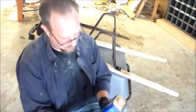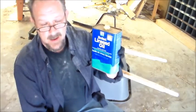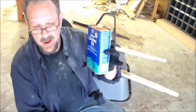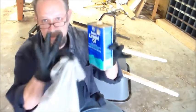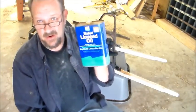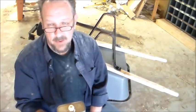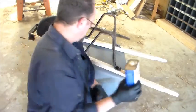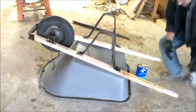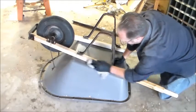All right, we're just about done. What we're going to do is put some boiled linseed oil on — this just helps protect the wood from the weather. You're going to want to put it on a time or two a year. If you leave it stored outside you might want to put it on a little bit more often. We'll put one coat on, let it dry, and then probably tomorrow we'll put a second coat on. I like to have gloves — this stuff really sticks to your hands and you'll taste boiled linseed oil in your sandwich tonight. Just use a cloth and put it on pretty heavy, wipe it down, and that's about it. I like to use this on all my tool handles, especially tools that stay in a cold shop or get exposed to a lot of weather — linseed oil is a pretty good way to protect your wood.